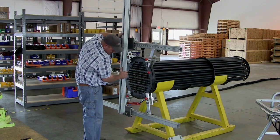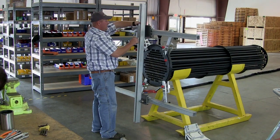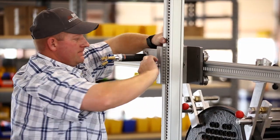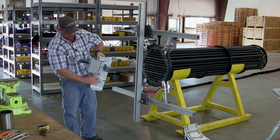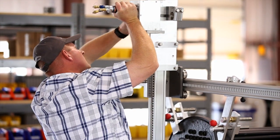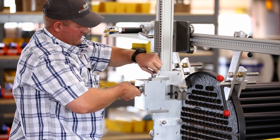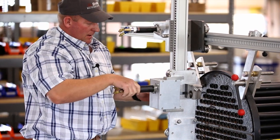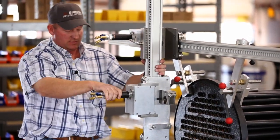As you're bringing this down, you'll want to engage these two rollers and leave about a foot above the clamp. This is a clamp that secures the vertical rail to the top horizontal rail. Now we can install the vertical carriage. It has a similar mechanism to engage the gear in the rail. In this position the vertical rail is engaged but the horizontal rail is not, so it will still slide freely back and forth.